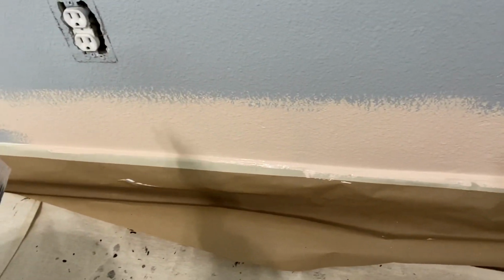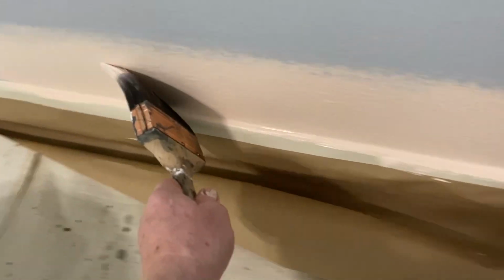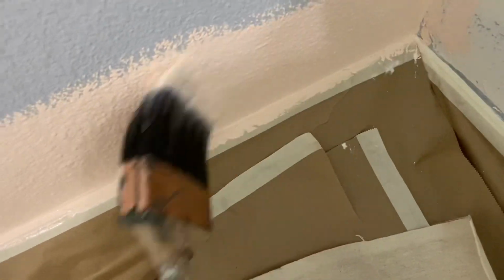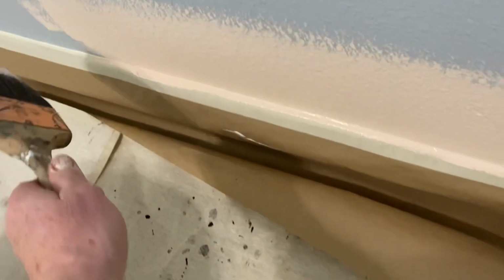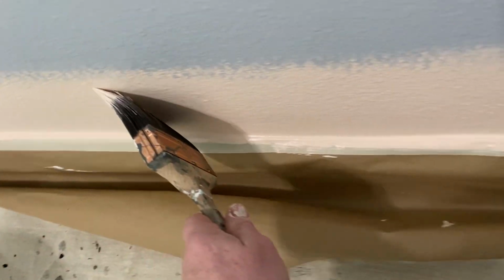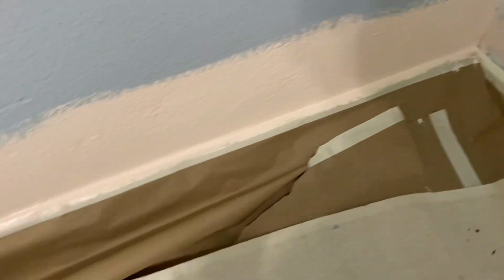So now that I've painted 4 feet of it, I just come back from the edge of the 4 feet and just do this. Where I left off. Remember I painted over here and I went like this? So then, this is the whole job. You're gonna do the whole job like this. You go to the end and you go right to where you left off and lift off like an airplane, thereby reducing the lap marks that are created from the brush.